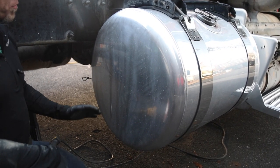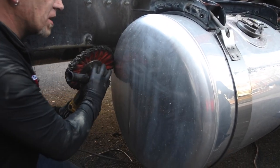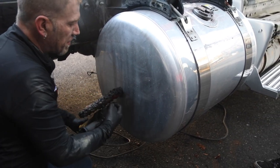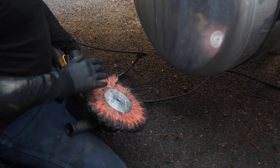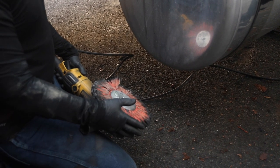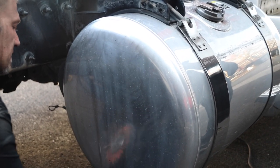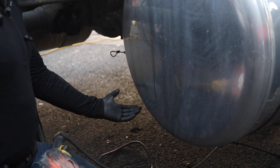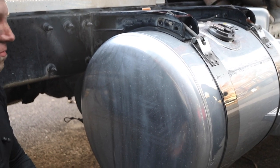When we get out to the edges we have to angle our buff to make it around the convex surface. We're going to back cut with the machine, load up with brown, back cut all the way down about halfway, reload while back cutting, then back cut even further. This is a lot of aluminum — a big surface — so it's going to gum that pad up with metal. You want to rake it out before you start your diagonal cut.